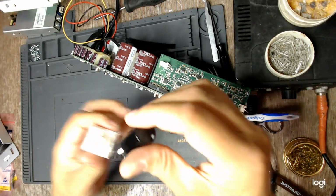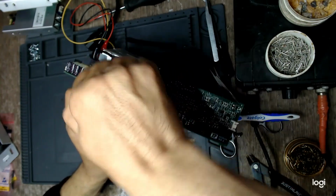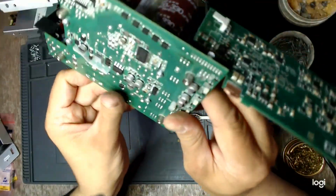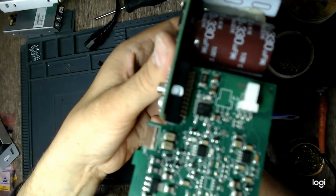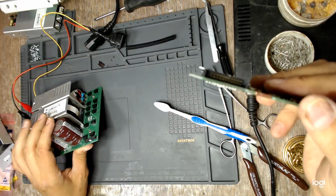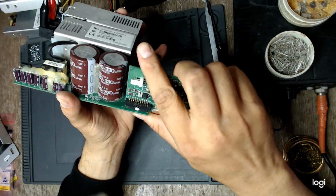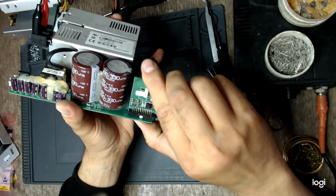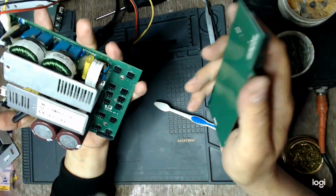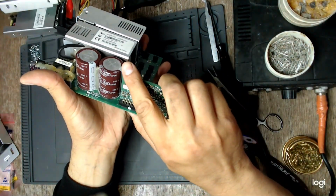So, this time I made sure it is connected okay, and I made a mark. I'm not sure if you can see, but the pins do line up. I made sure of this. I did clean up this side of the connector. So now you cannot make a mistake. You see? The mark needs to be on that window. I'm not sure that this was the issue, but at least we have redundancy.